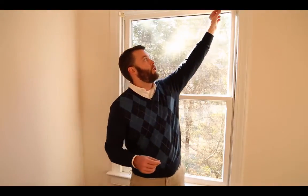Now the blinds we had here were cheap pieces of junk, so you probably wouldn't reuse them anyway. But assuming you have nicer blinds, you're going to need brackets that attach a different way in order to fit on there. If you have fancy new blinds, you should probably call the company that sold them to you. They'll probably be able to provide you with a new bracket. But the moral of the story is, to understand whether or not your blinds are going to fit, you have to understand how the new windows are going to go in.